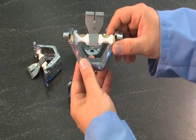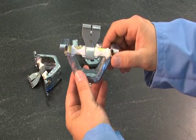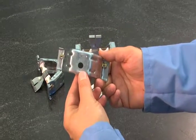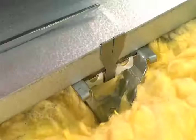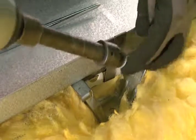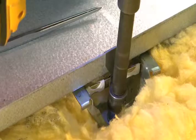The MR24 panel clip has many features that make it superior to other manufacturers' roof panel clips. Starting at the base of the clip, there's a factory punched hole for the self-tapping screw bolt to fasten to the factory punched holes in the secondary structural system. Competitors have to use two fasteners to achieve the pull-out strength of a single Butler screw bolt fastener.